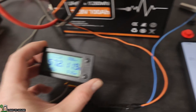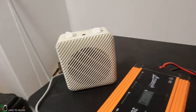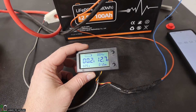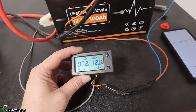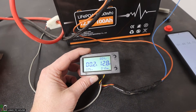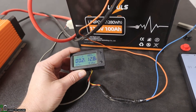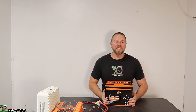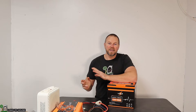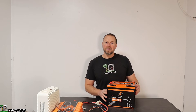At an hour and 48 minutes, we have 0.6 amp hours remaining and 1.2 kilowatt hours used — so this test is now done. I'm happy to say the battery has performed quite well. Now that the load is off, the voltage has gone back up to 12.7 or 12.8 volts. When this battery is fully discharged, 12.8 volts is what we want to see — during operation it was dropping to 12.5 or 12.4, but it's healthy at 12.8 with the load off. The LiPulse 12 volt 100 amp hour lithium iron phosphate battery performed as expected and to spec.